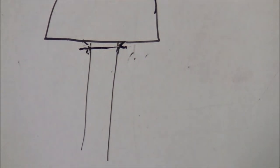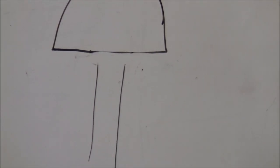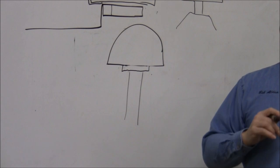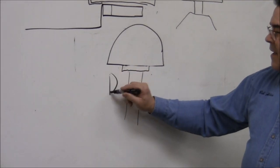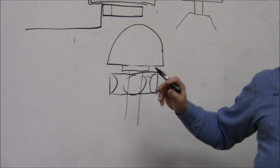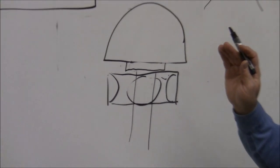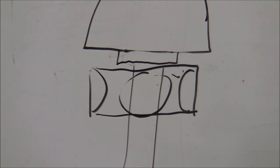You definitely want to stay away from that little rounded section. Porter-Cable bits, in their wisdom, put a sharp step in it, thinking that'll fix it and allow precision positioning. The problem is that when you have one of these collets, it has a nut that typically sticks up beyond the collet. Now when you drop the bit in and start tightening the nut, the bit doesn't necessarily drop down — it's no longer resting right on the collet. So precision's out the window. You do get a good grip, but it's not necessarily at precisely the same height every time.